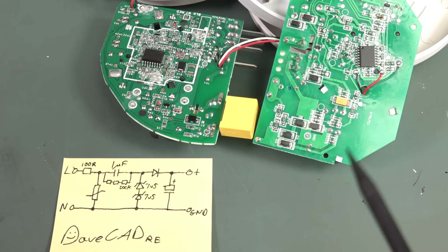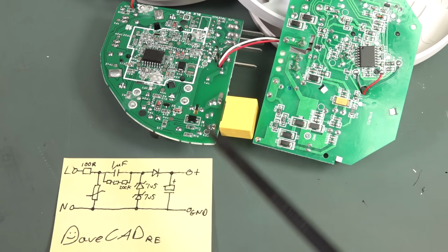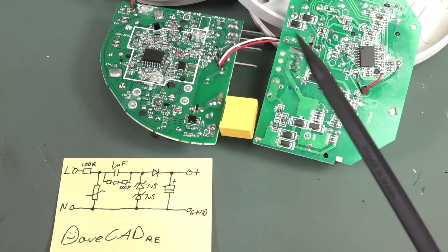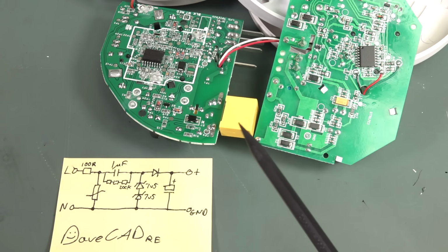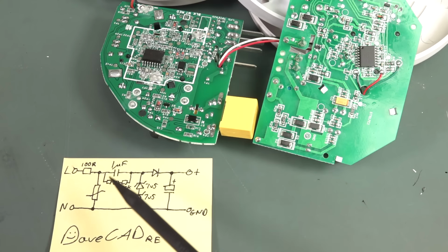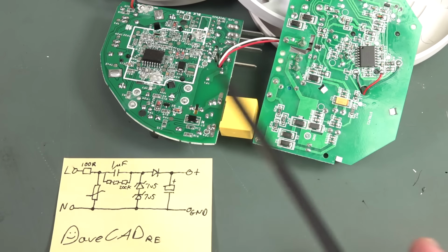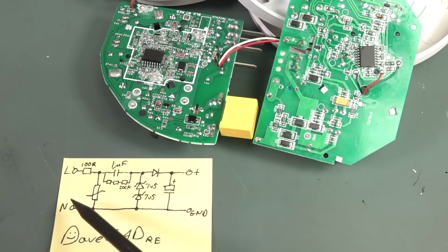Now, of course, these are what's called a direct mains connection, non-isolated power supply, and these are inherently dangerous. You do not design these except in products that are fully enclosed like this, where the user can never ever touch the electronics in them, or shouldn't. That's the entire point, because it's more cost and complexity to put in like a mains isolation transformer and everything else. But in these types of products, it's no problem, and it's completely legal to have your circuitry over here mains referenced over here, even though it's the neutral.